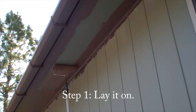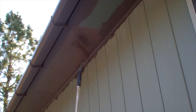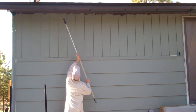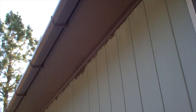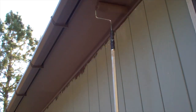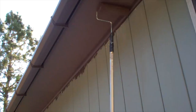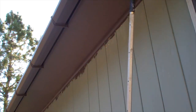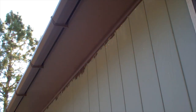Give the roller a little twist to make sure there are no drips coming off, and you're ready to go. Here's the lay-on — not really worried about being extra neat, just getting all the areas covered. Now I'm going to do my lay-off. Start back where I started, go nice and smooth without applying too much pressure, then follow that straight back and bring it off. That's going to help those roller marks disappear. Do the same thing over here — nice and light, nice and smooth. Get it all uniform, go back, and lay it off. Then move on to the next section.